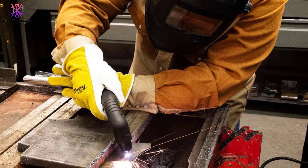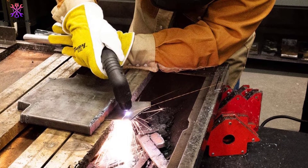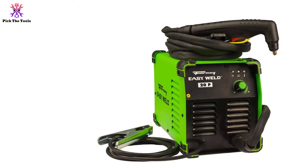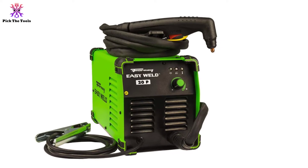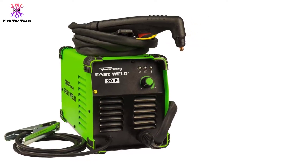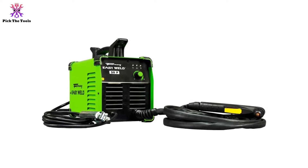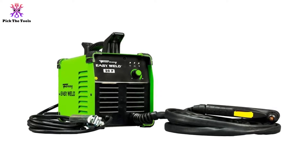The included cutting torch is designed to be dragged directly across the metal surface — this uses up more consumables per cut, but it also allows you to use the sheet you're cutting for balance, and precision cuts are narrow and easy to keep straight. The biggest downside to the Forney plasma cutter is that the duty cycle is extremely low at just 35%. That means after cutting for 3.5 minutes, you need to let the cutter rest for another 6.5 minutes. There is a temperature indicator on the unit to warn you when it's close to overheating.